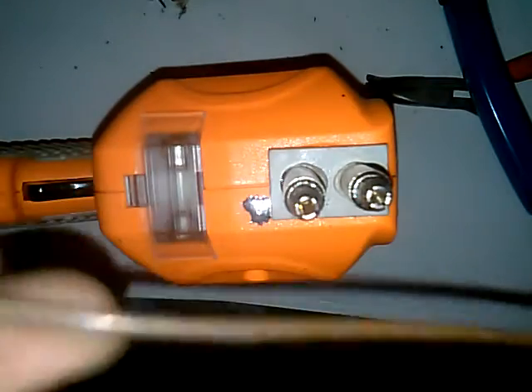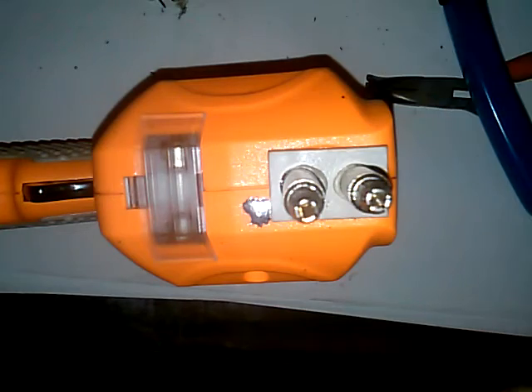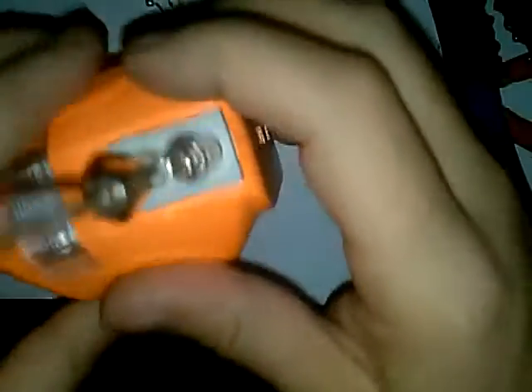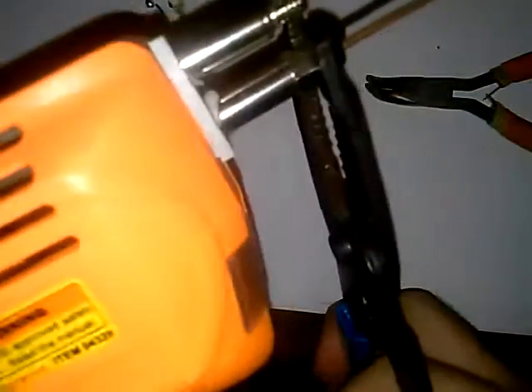Take this and it will go right in there. Since you don't need to bend it, you can just put one in and put it on down. The thing with this type is that it may not like wire smaller than 12 gauge. This happens to be 14 gauge copper wire, so you really have to get down on this nut — just tighten it up as far as it'll go to compress on it and it'll be just fine.